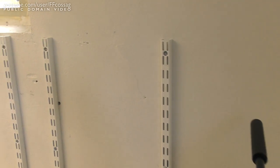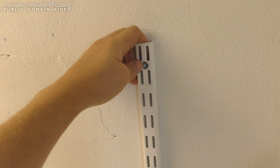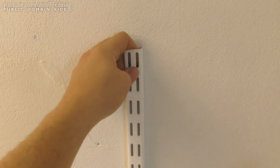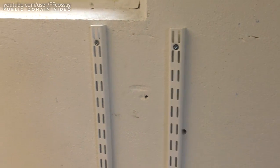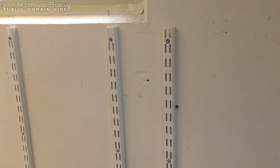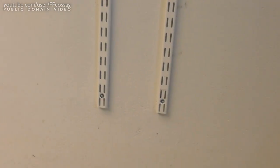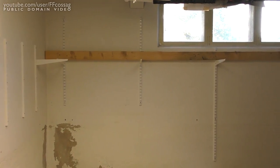It is rather amazing how big a quality difference there is between SDS holes and hammer drill holes. I used an identical size drill bit from the same manufacturer for the old holes except I used a hammer drill, and those are so floppy — if I take the torque setting which was slipping on those, I'm pretty sure any of them would just spin. It's just staggering, absolutely staggering how the right tool makes the job so much better.